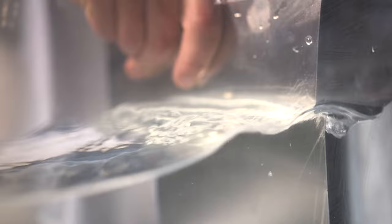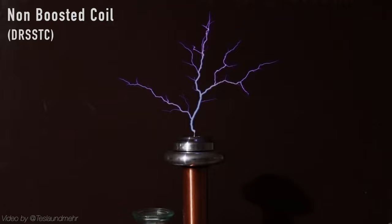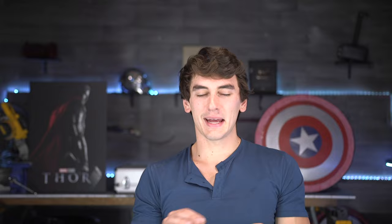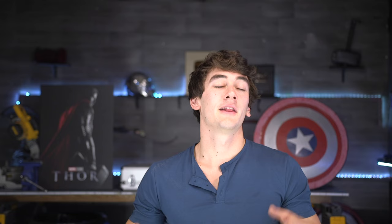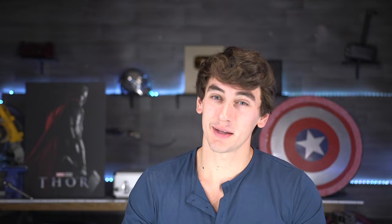We can take it even further by changing how we make the waves. Instead of just quickly pulsing back and forth, we slowly ramp up the voltage throughout the push. Something really cool happens: as the spark breaks out, the voltage starts to increase — this turbo-boosts the spark, allowing it to grow much larger and straighter than any other coil. That's the secret behind these massive sparks. It's called a Quasi-Continuous Wave Double Resonance Solid State Tesla Coil — holy mouthful. The name perfectly describes just how complicated this thing is to make.